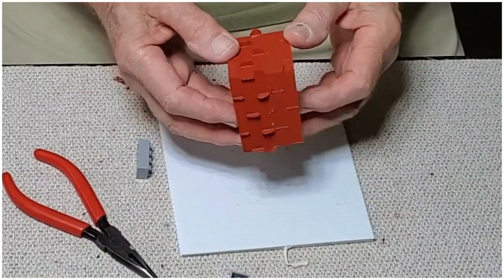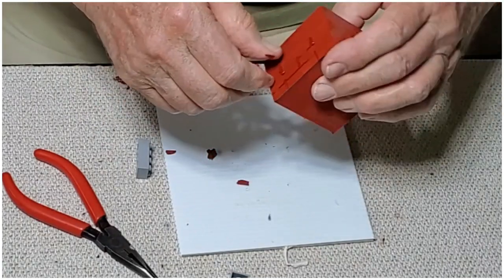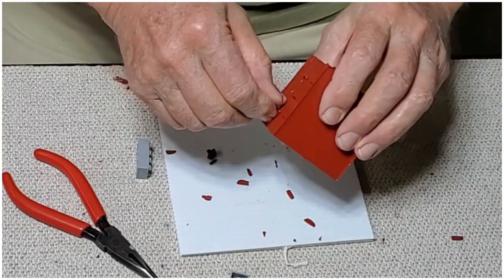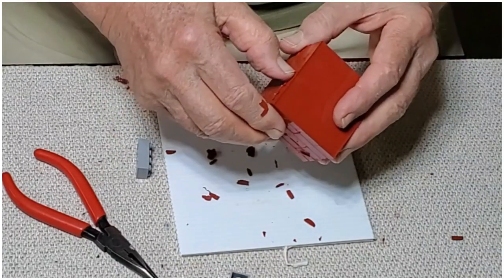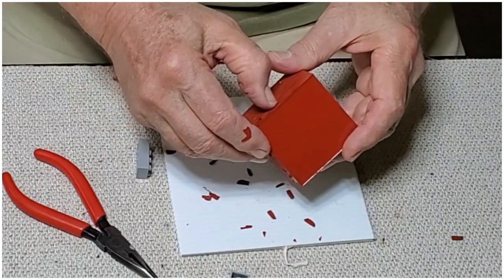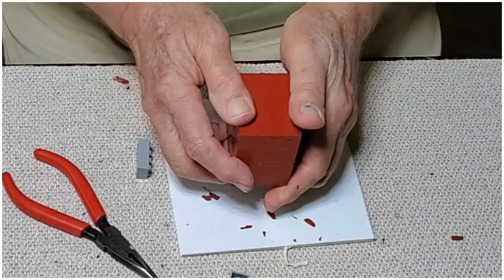So there's our mold. We have to go ahead and clean up the outside of it. We'll do some trimming on the corners because when you pour, it'll be clamped between either a couple of pieces of wood or a couple of pieces of metal, and this little edge here, the meniscus, has turned up, and that will affect the clamping device. So we'll trim that off a little bit. Okay, that's pretty clean. Let's see if we get her apart.